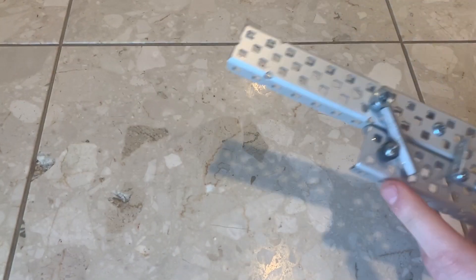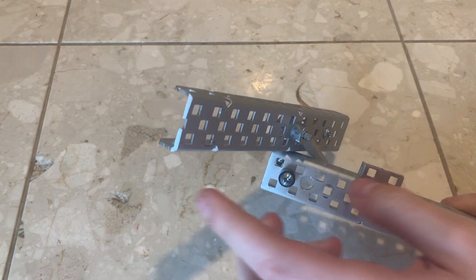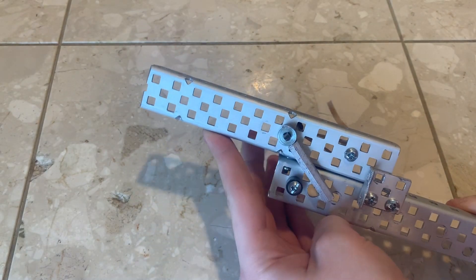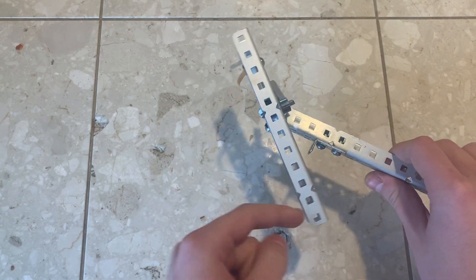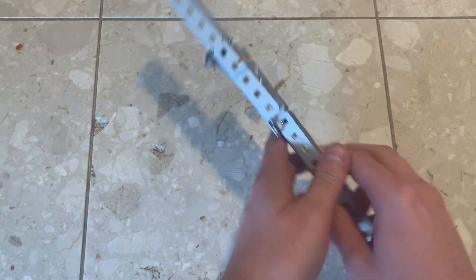This one I'll call the overlap. This one simply has a screw with a teflon washer between as the pivot, with the second bar stacked on top. The whole assembly pivots around before getting stopped by this small L beam. You could maybe use a plate for the stop, but if you're using a lot of rubber bands on the mechanism, that has the potential to bend out, so I'd recommend using either L channel or C channel.